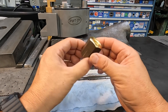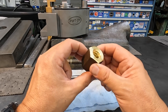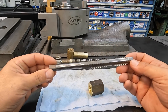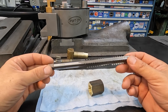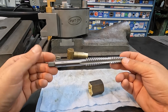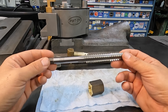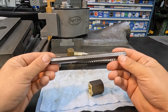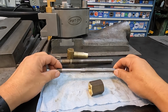I think that went well. We've got our test nut now machined and the tap did a pretty good job — it made a really nice, high-quality thread. Our Acme tap did great. By the way, I got this from McMaster-Carr. They have a whole range of Acme taps in the tandem style, probably a lot of them in stock. This one is made by Widell, USA made, and it's good quality — it ran about $164. Not bad at all, especially if you've got a lot of parts to make with an Acme thread.